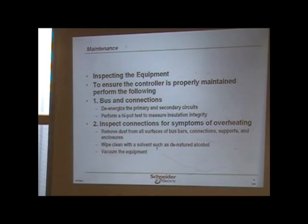But those are the factors when it comes to troubleshooting, especially what you were talking about. You have to determine and say, okay, is all this other stuff good? So you isolate the motor at that point. Or the first thing you might do is go ahead and put the ammeter on instead of checking all the other stuff, and then say, okay, am I drawing too much current? So you figure out if the motor itself is the cause, and then if the motor is not, then you can start troubleshooting and saying, okay, do I have enough wiring, or is the wiring correct, or are my settings correct?